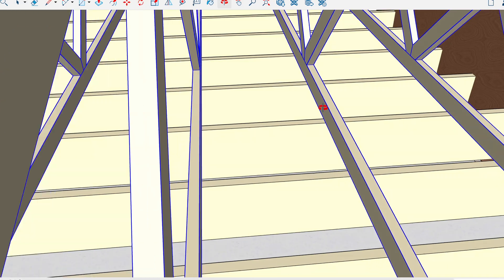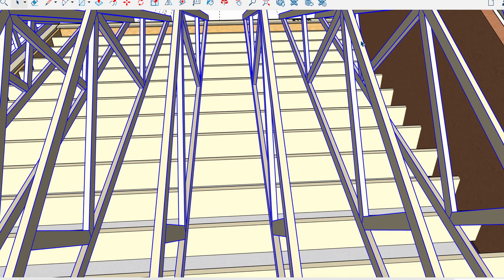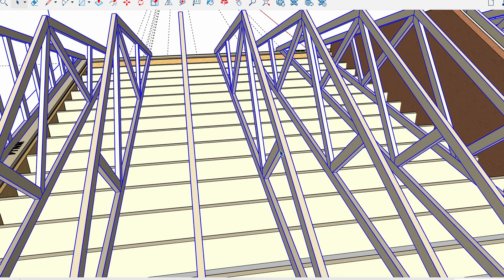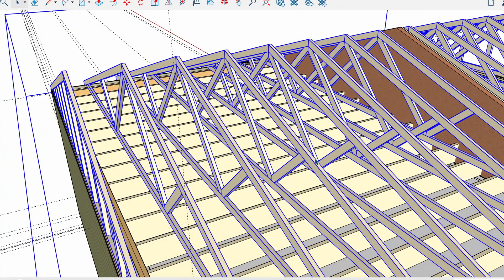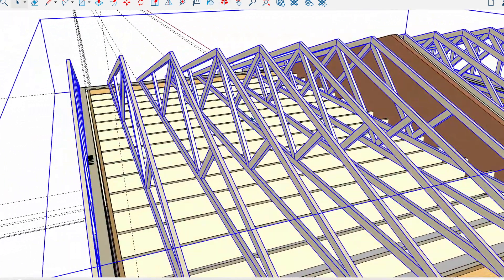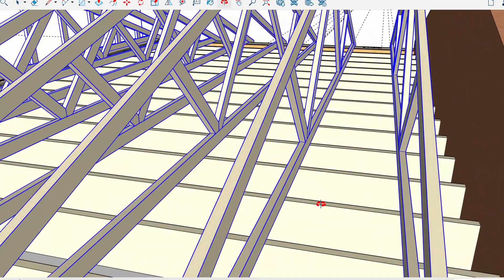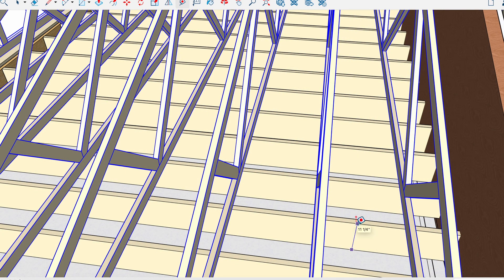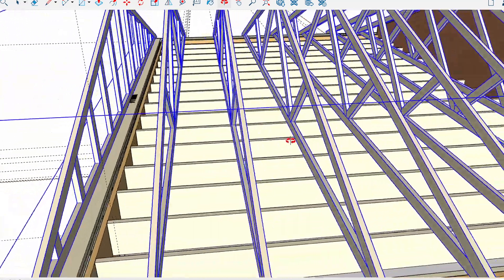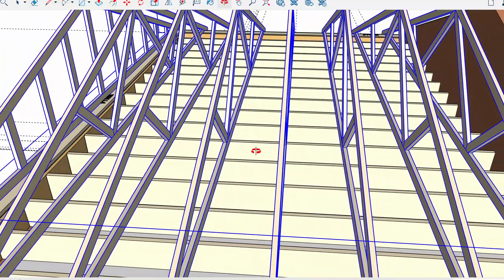Most people don't realize that this bottom joist typically has a dead load capacity that can support about one layer of drywall at most, because it was designed as a garage — not meant to hold a lot of weight. This is known as the bottom chord dead load. Always ask the joist manufacturers — many have an engineering team on staff who will advise you for free about whether modifications are safe. In our design, we're using two-by-twelves to hold the ceiling weight, which includes not just the drywall but also ceiling acoustic clouds we'll be hanging from it.